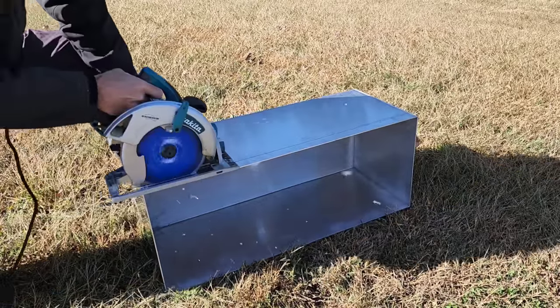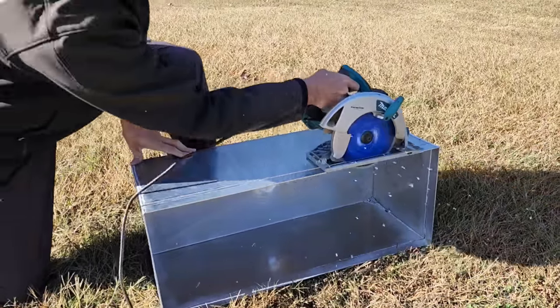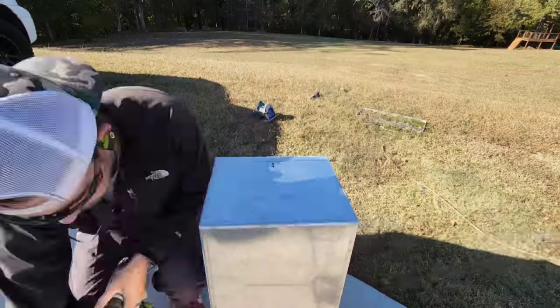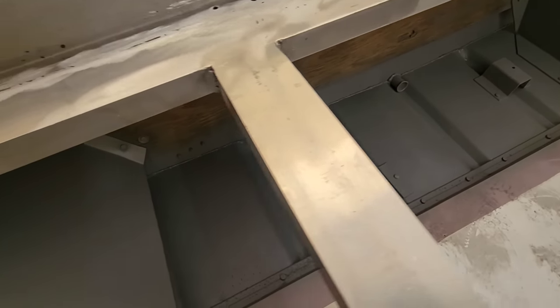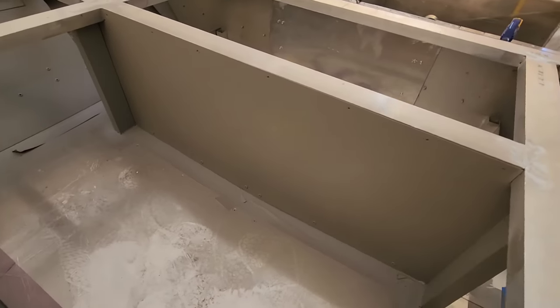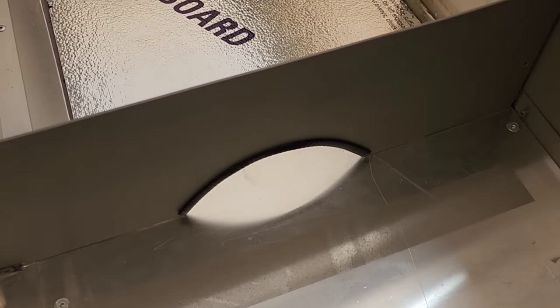It was now time to do the Livewell. I began prepping the aluminum Livewell tub I received from tbnation.net. I shaved a bit off the top, and then I drilled a pump-in and overflow holes. Meanwhile, in the back deck area, everything was taped off and sprayed matte gray. You may have noticed a few shots back that all of the aluminum work in this area was sanded first, then it was cleaned before paint, ensuring that all the paint work sticks and doesn't flake off.